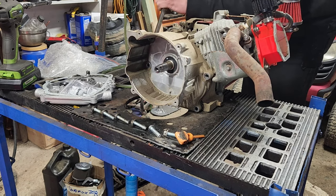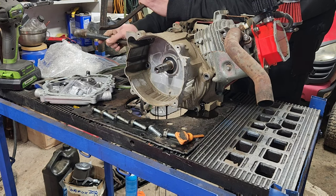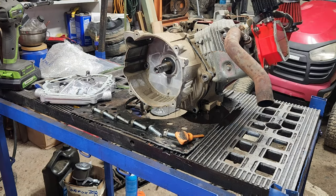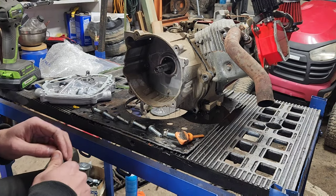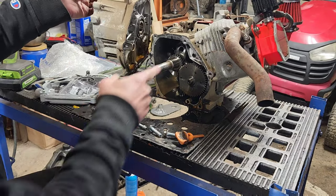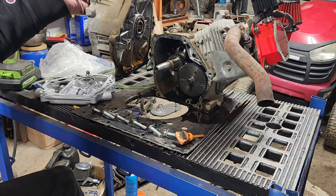There are a couple of tabs right here on the generator case that I'm assuming we can tap on. Judging from all the oil mixed with gasoline coming out, we got that right. I wonder if somebody was already in this thing, because it almost looks like two gaskets coming out. I've got most of it in the cat litter container. Let's pull this off. There's our crank, there's our cam. We're going to rotate this until we get the dots lined up so we know the cam is where it's supposed to be, just in case we drop anything.